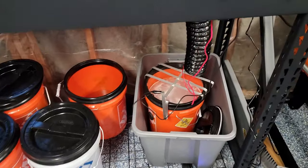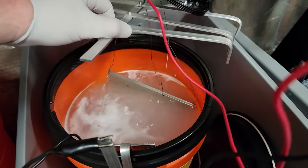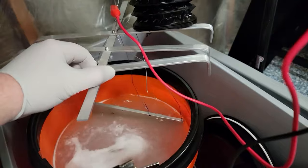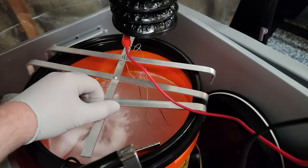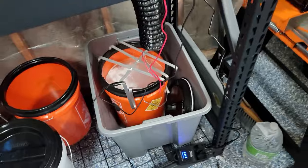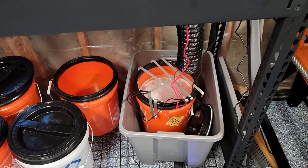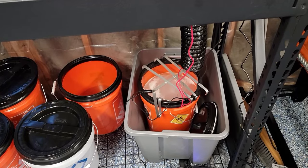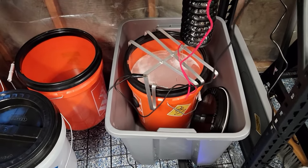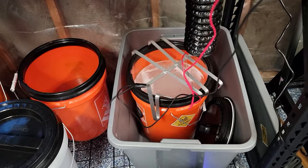Another update — we are about one hour in. If I pull this out, you can see there is a nice dull coloration, so I think there is a good layer of oxide on the part. I'll gently lower that back down and try not to touch the cathode. Looking back at the Caswell calculator, I actually need to leave it in for two hours. I'm aiming for a one-mil thickness — originally I had half a mil in the calculator which was one hour, so I need to leave this for two hours. Then it's going to go into the dye.